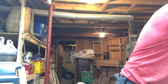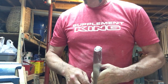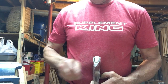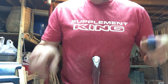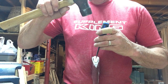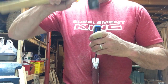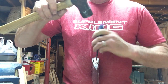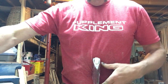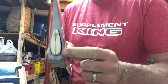I'll set the sharp point — the heel — on a little piece of wood on the bench. Now I'm going to take my flat screwdriver and see that it's open halfway down but it's closed up where we've been tapping it out with the drift. I just have to tap it in and wiggle it back and forth to open up this kerf again. The screwdriver will do that for you. I'm opening up the kerf so that my wedge will fit in there smoothly. My kerf has been cut almost halfway down, and I've got about two mils on this side and a mil at the back on the other side — so I have three mils to take off at the top.